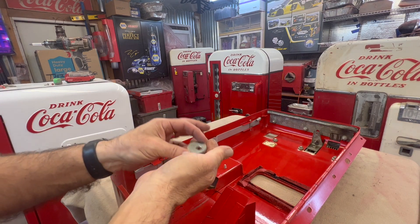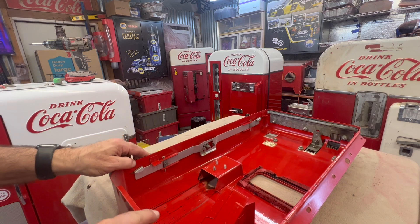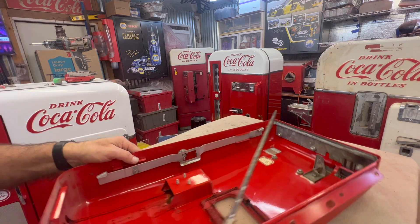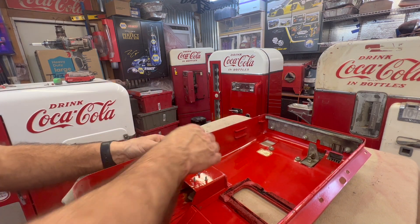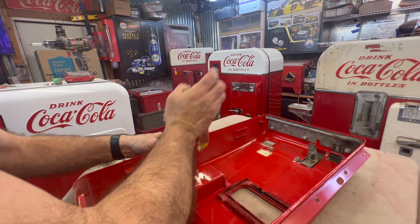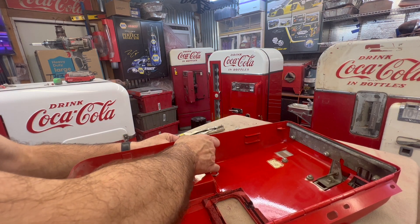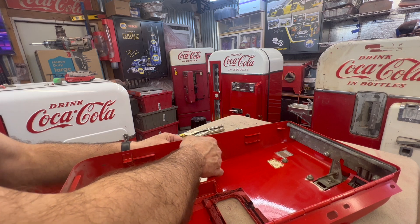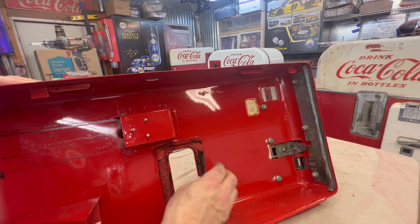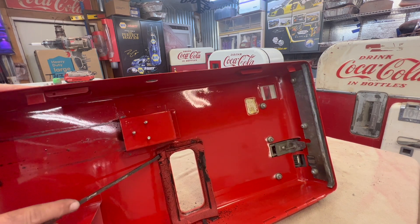Yes, we will try to save every piece because we're gonna put that lock back in. You'll have three pieces that kind of come off there - hang on to all that stuff. You'll pull these two pins here. Lock assembly is out. One more big nut on the inside - get it loosened up - and there's one washer that goes up against there, remember that when you're going back together. Take those gaskets out, don't leave those in there - you can get new ones.